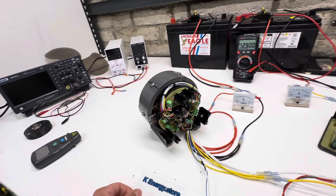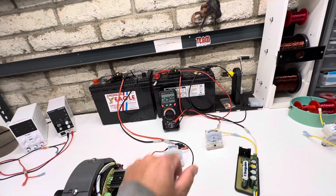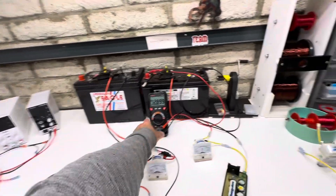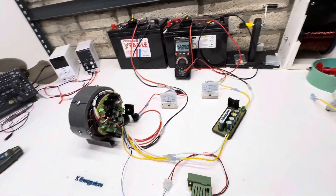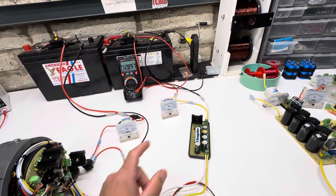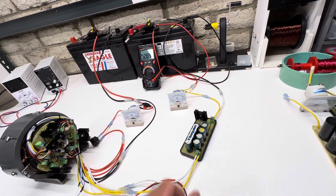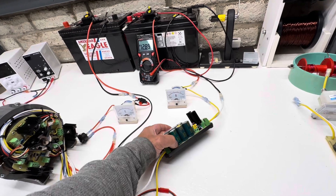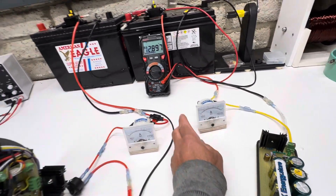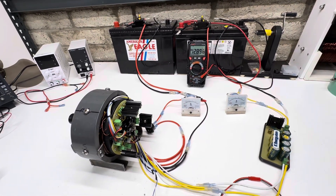I just got it put together and need to do a little more tuning. On the previous videos I was using 24 volts, but tonight we're only using 12 volts. We've got 12 volt run battery and charge battery. This time I have a cap dump hooked up — 80,000 microfarad at 35 volts — and we'll be pulsing this at 18 volts. This is our little analog amp meter, both are five-amp meters, so it's easy to see what's going on.